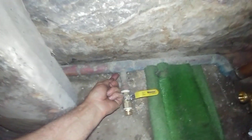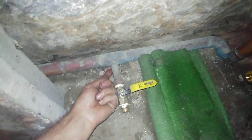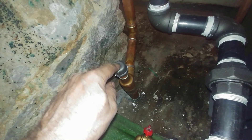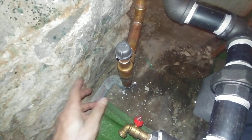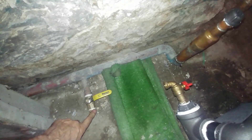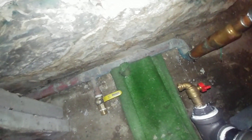The reason I have this is so — if you see here with this T — even if you drain, at least a third of the pipe is still going to have water in it. So if you want to get as much water as possible out, I like to have a dip tube. You drain it, take this off, run in a dip tube, and you can suck out much more of the water. We've got our valve there so this can be shut, and this can then be led away to do a no-return flush — to get rid of any dirt, rust, and contaminants coming back.